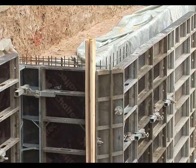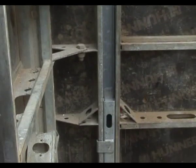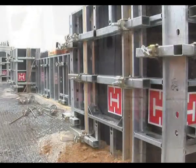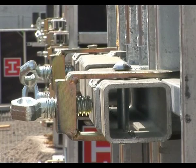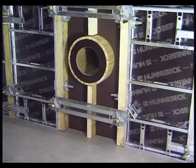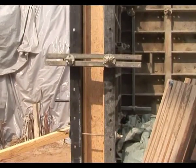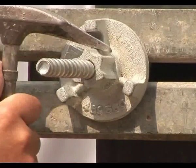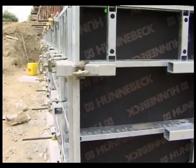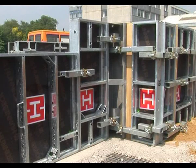The connection is either by combi clamp or with a centre tensioning clamp. Being infinitely adjustable, the combi clamp allows for compensation up to a width of 15 cm. For compensation over 15 cm, an extension bar is available, but squared timbers can also be used on the inside. The angle clamp ensures precise right angles and solid connections on the outside surface — a one-piece clamp just as easy to use as the Rasto clamp.